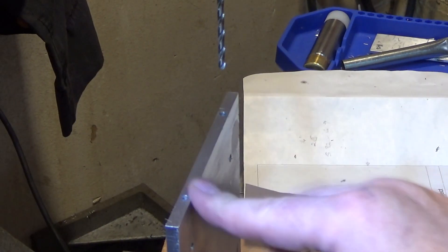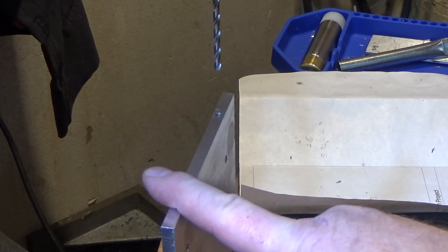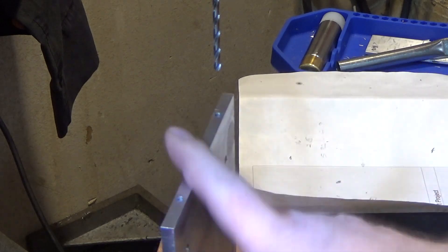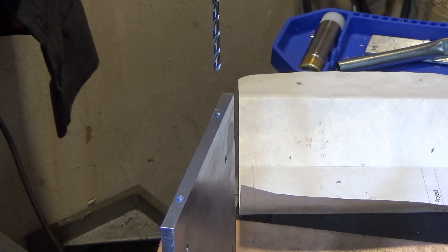That's it for the second one. Every time I flipped and even replaced the plate, even though it lined up perfectly, they were off by four or five thousandths. That other one was off by a ton - like maybe twenty-five, thirty thousandths. I'm not quite sure why it was so far off, except I think maybe the plate has some bow in it, which I'm going to have to look into because that may affect how well this thing works.